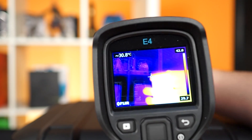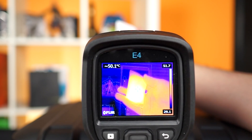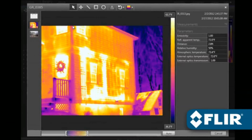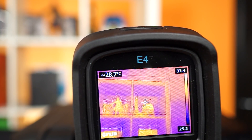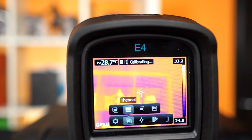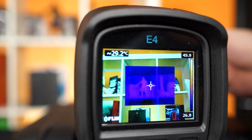When you compare it with professional-grade thermal cameras, you can instantly see the appeal of the $250 Seek. It even lets you record videos. One feature it's missing is the lack of raw data output. With the FLIR E4, it captures everything in a raw format that you can extract later with their FLIR Tools software — you can choose between separate modes or pinpoint different areas after you've already shot your images. With the Seek, what you see is what you get: you shoot an image and you get a JPEG of the exact scene. Another feature we'd like to see is the FLIR's multi-spectral dynamic mode, or hybrid mode. The FLIR has two camera sensors — one for regular images and one for thermal — and combines them into one image so you get the sharp details of a regular image with the thermal information overlaid.